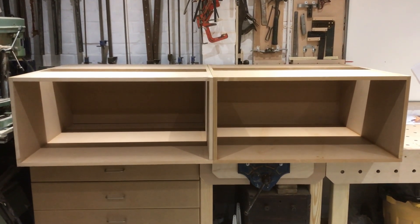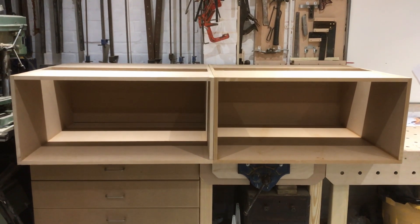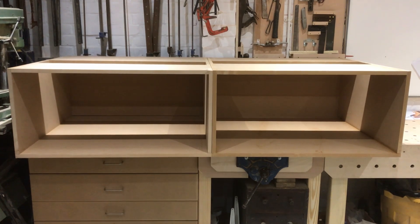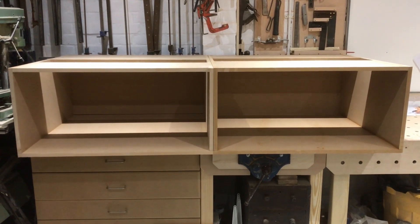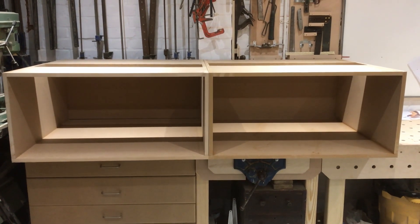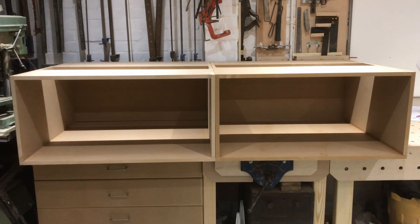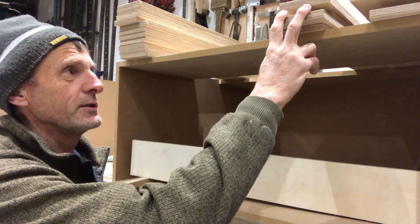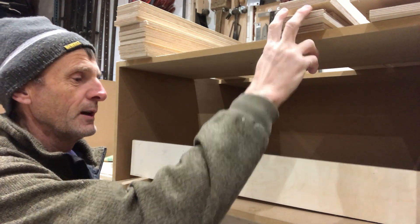It's about 30mm up, just enough space to level them up. I just need to make six drawers to go inside them. I'll make them all out of birch ply — I'll cut all the ply up and then come back and show the assembly of the drawers. I've ripped all the pieces of birch ply down ready for the sides of the drawers.